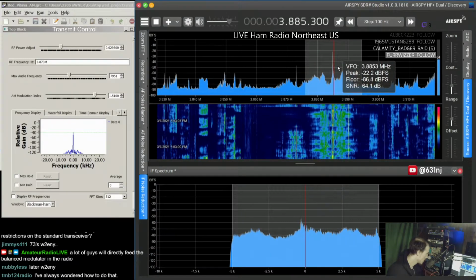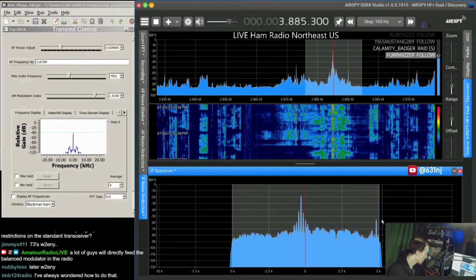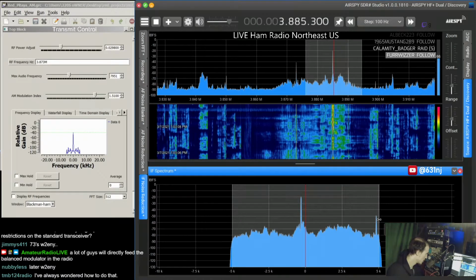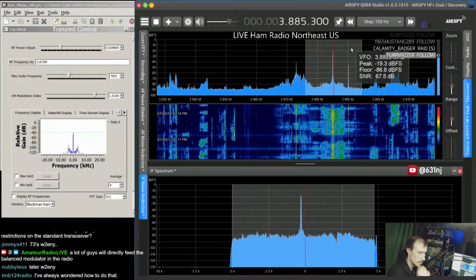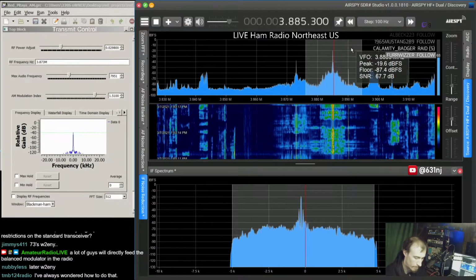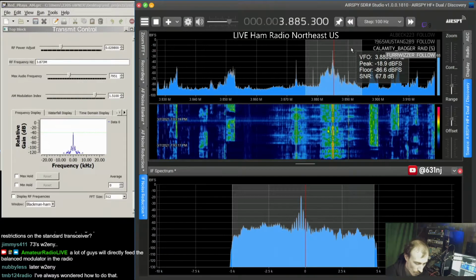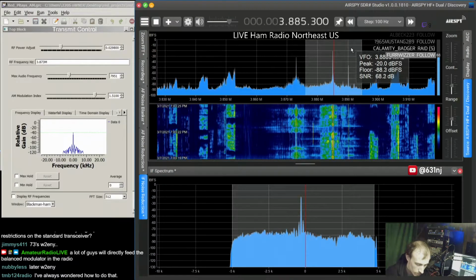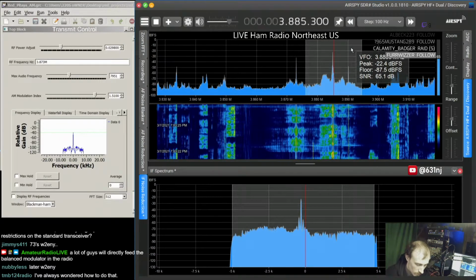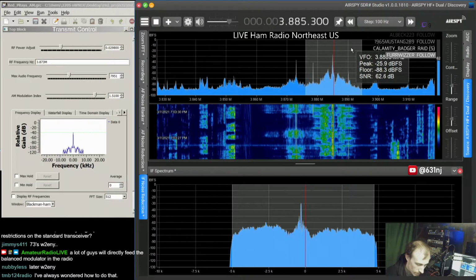There are octal tubes. I'll take a guess and say it's probably early 1950s vintage. And those receivers can sound really, really nice. You don't have crystal filters or magnetostrictive filters in there to muck up the quality of the audio. And it probably has a pretty decent audio output stage. I think you got yourself a nice receiver there.